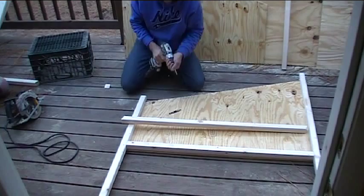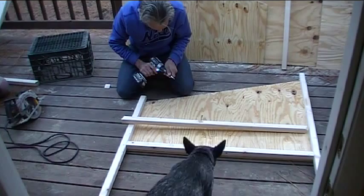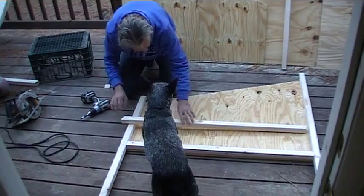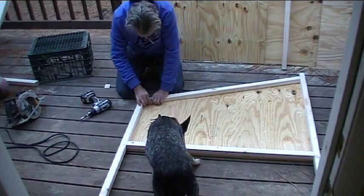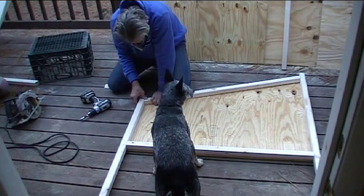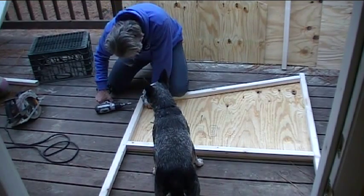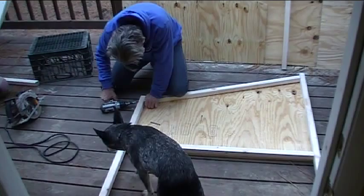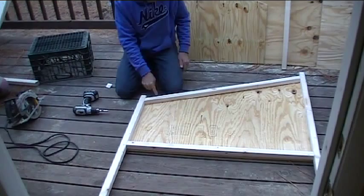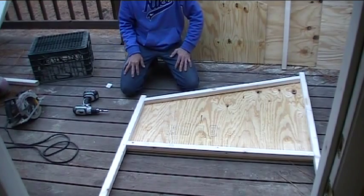I pilot drill lots of stuff when I put things together, and when I make things out of wood I love to use screws — just drywall screws, three-inch ones. I use them quite a bit. I really like it because if you ever want to take the thing apart it's a lot easier, and it also makes for really strong construction. Now we'll flip it over, put screws in along here, cut these off, and this side will be done. Then repeat the process for the other side.